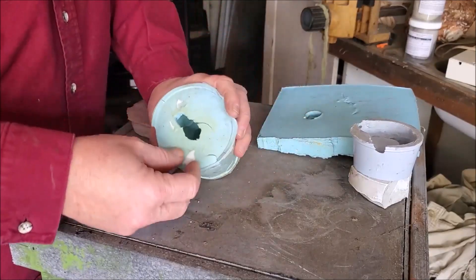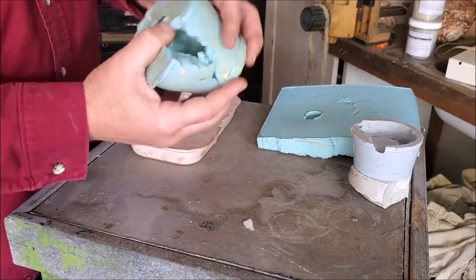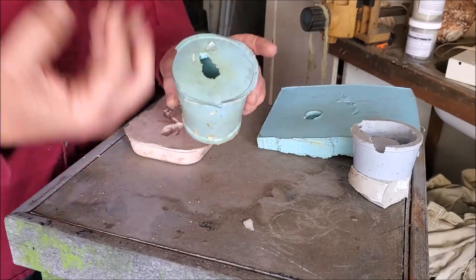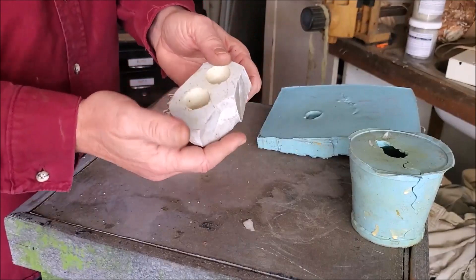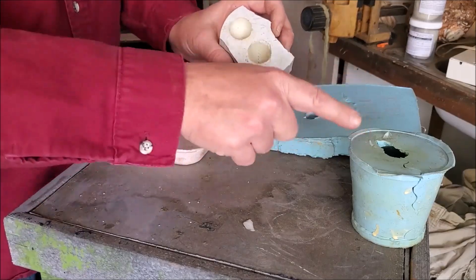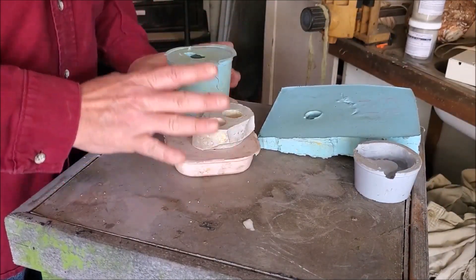This other mold I've been casting resin in for years — it's about 25 years old. It was poorly done in two ways: it was quickly put together as a single-cut mold with a lot of undercuts, and resin leaches all the silicone oil out. Finally, I have a third mold — platinum silicone — which has had maybe a couple thousand pulls. It's much tougher and has lasted longer, but it's starting to deteriorate, also from resin casting. All three molds are about 25 to 30 years old.